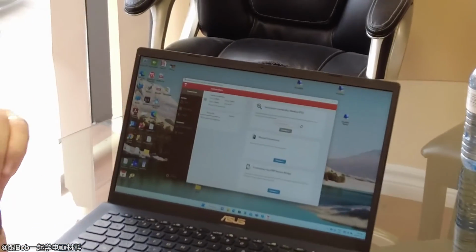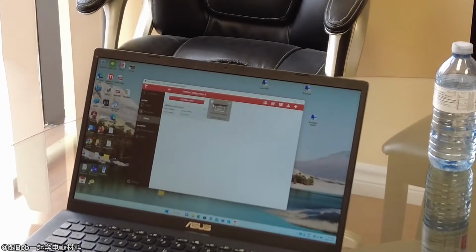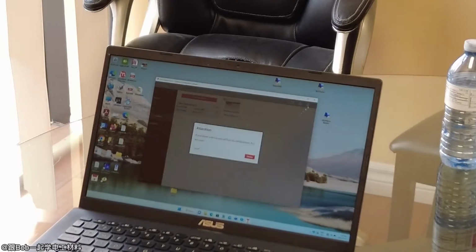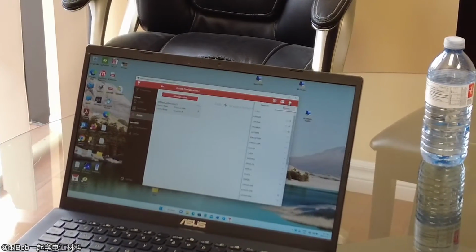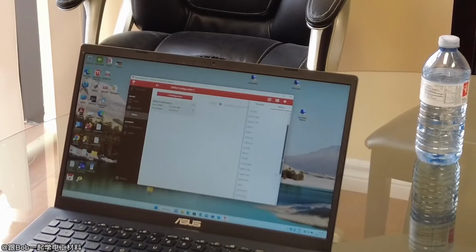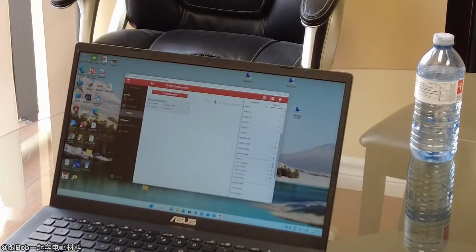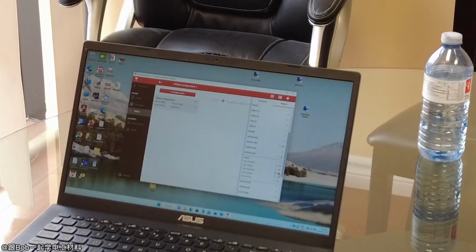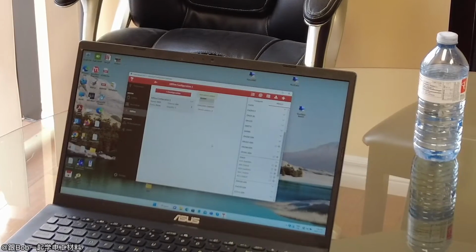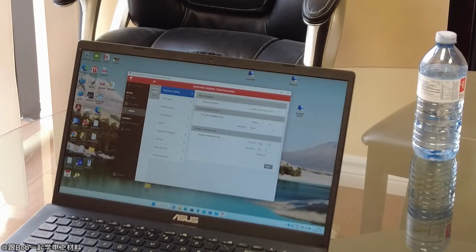So what we can do here is we can go offline, and I'm going to delete this. One way we can do is we can add a meter. That's going to be EM50, and I've got the MA51, which is the 80 milliamp input. I add that, and that's it. Okay, so I can change all the parameters I want.